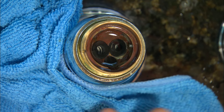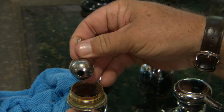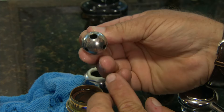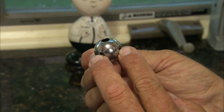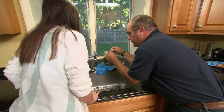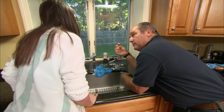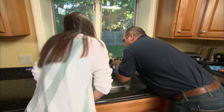See the two black things right there — the one on the left is hot, the one on the right is cold — and it's full water pressure coming up there. When the handle is full forward, this ball seals against those rubber seats and the water is off. But if we pull the handle back, the two openings line up with the two seats at the bottom, so hot and cold mix and go out through the spout. Go to the left and you just get hot; go to the right and you just get cold. This is stainless steel and it generally doesn't wear out.